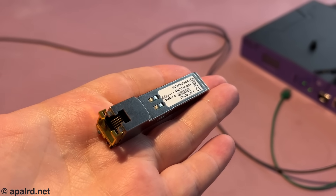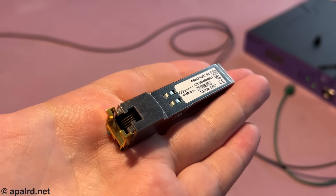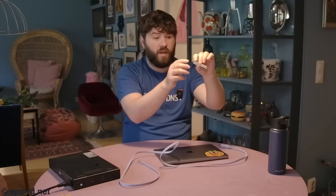That is this little thing right here. Now this might look like it's a standard SFP to RJ45 Ethernet module, but actually this is a full-on server. It has an IP address. It has an RJ45 serial console port, and it lives inside of the SFP cage on your switch. So you use a spare SFP cage on your switch, pop this guy in, and you can loop this to the console port on any of the networking gear in the rack and manage it remotely from this little thing here.